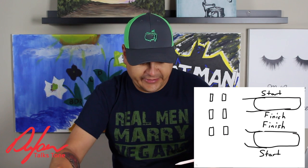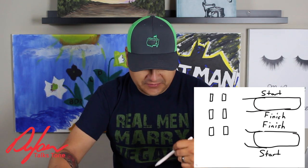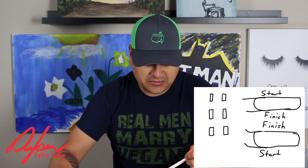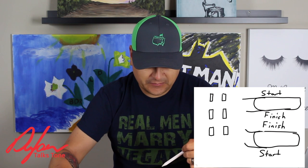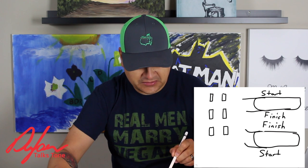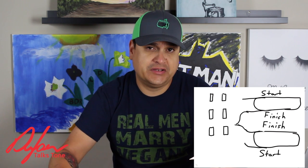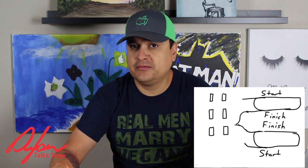I've got two little things drawn here — my super awesome artist hands. We have two coils of a humbucker and there's usually four wires. Now you have to have a four-wire humbucker to be able to do this. There's of course a start and a finish wire to each coil. What you do is you take the finish wires from each coil and you twist them together, and then those are going to be wired to a switch that's going to go to ground. You need to know the color code of your humbucker to be able to figure this out.